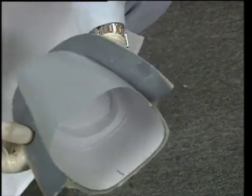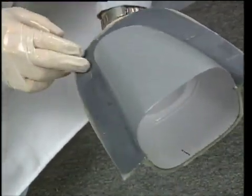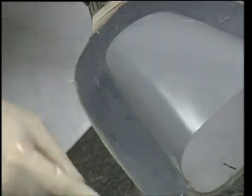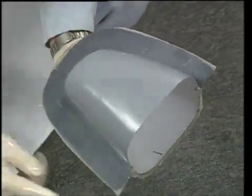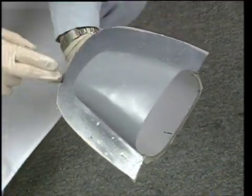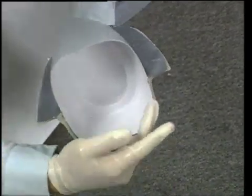Now that the mold is washed off and the PVA and excess clay are removed, the next step is to trim the outside edge. The surface coat is only out about an inch, but when trimmed with the knife, I came out just a little bit extra so I wouldn't come too close to the plug. I'll take a Dremel tool and trim back nice and neat right up to that surface coat layer, and also trim back the back edge of the cowling.